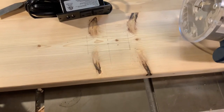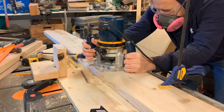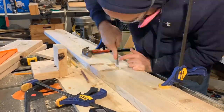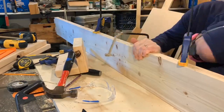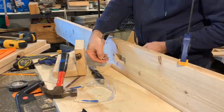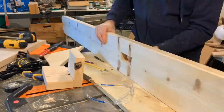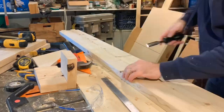Time to gear up. You can see I've got a clear adapter plate for my router, and then I've got a collar and a bit so I can get in there and do what I need to do. The clear plate makes it a lot easier to see the work. Then I just hog out the rest with the coping saw — made pretty quick work — cleaned it up with a chisel, and then we were ready for the next step.